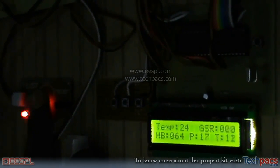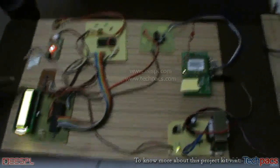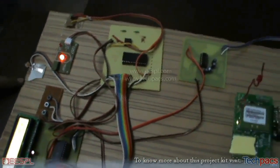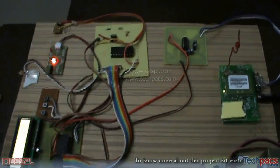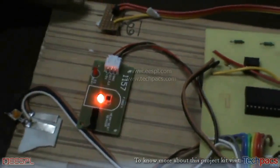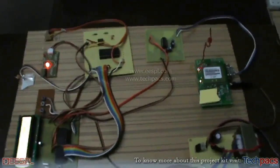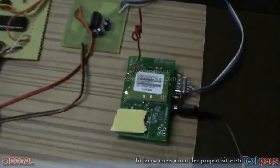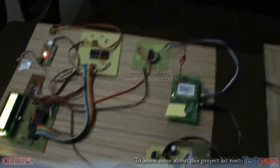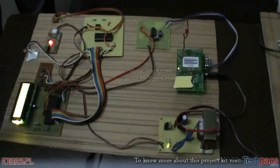These three parameters are more than sufficient to measure the complete health of an individual. The three presets set the maximum values for the galvanic skin resistance, the heartbeat or blood volume pressure sensor, and the temperature sensor. If your body readings exceed those values, the GSM module will send an SMS to the registered number — which could be your doctor's number — so in an emergency your doctor will know your health report within seconds. This is a wonderful creation. Thank you so much.